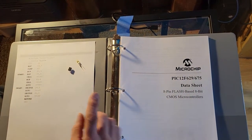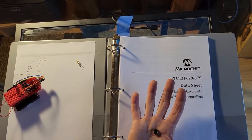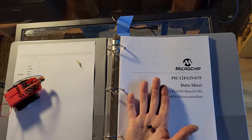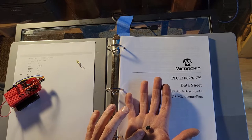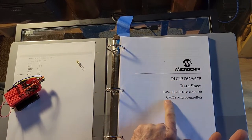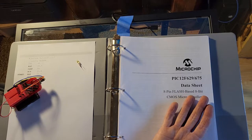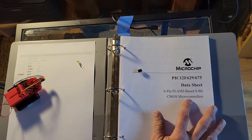This is from Microchip. Microchip does sell a variety of chips, everything from this little guy down here all the way up to ones that have like 100 pins, and they have a lot of different things you can do with them. This little chip can do a lot of different things — it has 100 pages of information here. This is a free download from Microchip and it's basically a PIC 12F675 data sheet, because this is a PIC 12F675 — an 8-bit microcontroller.